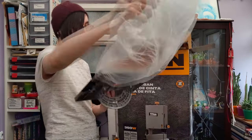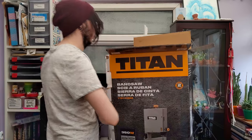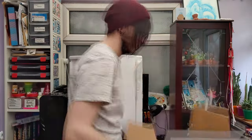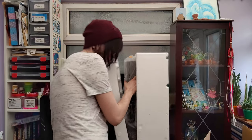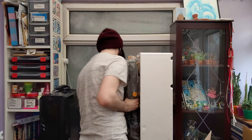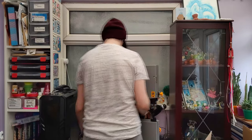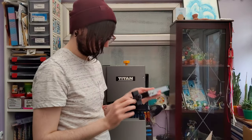One thing I'll say about this unit is the instructions were terrible — really unclear. There are things I knew I'd have to do that aren't mentioned at all, like the blade guides — I want to say bushings — two little pieces of metal that sit either side of the blade and almost pinch it to stop the blade from wandering. The instructions don't mention that at all. I know it from watching other videos. I didn't actually do it and I should have, because you can see the gap is massive. There's also blade guard guides above and below the table that aren't mentioned anywhere.